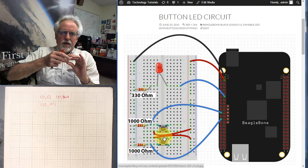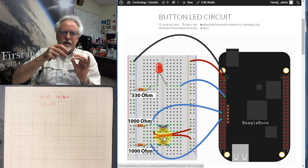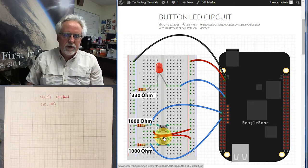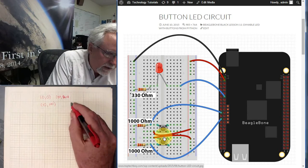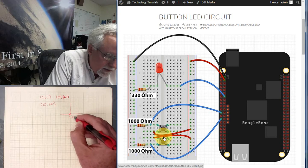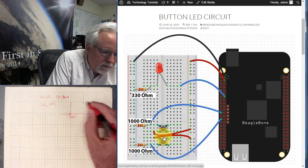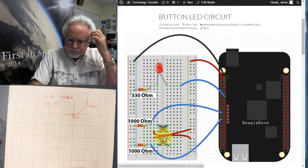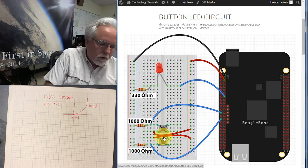Now what I'm telling you is you can't fit a line between those two, because all your action is going to occur down here, and then up here you're not going to see any changes. So the last 4 or 5 button pushes, you wouldn't see any changes. So we need to fit an exponential between those. This would be the point 0, 0, and this is the point 10, 100. But we want to come up like this with an exponential. How can we do that? We can do that with this equation.